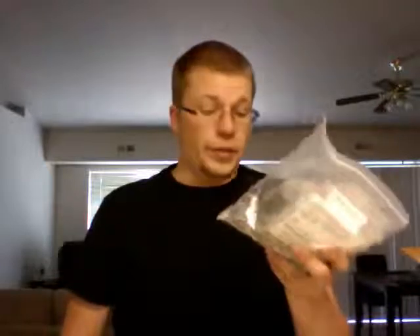I have this giant bag of stainless steel hardware. I'm not going to go through this line by line because it's washers, nuts, and bolts, a couple of springs, and then the belt mechanisms. Now this is all stainless steel. For any of you putting this kit together and having any issues, buy stuff called anti-seize — it'll be like $15 and it'll look like a tube of glue. The kind I like is the Loctite silver anti-seize. Stainless steel has a tendency to bind, so if you have that issue, just a little bit of anti-seize will keep it from binding up.